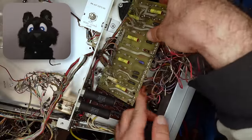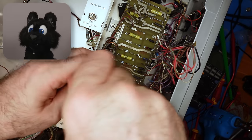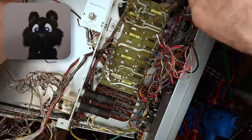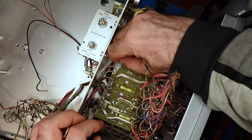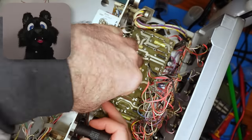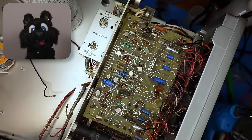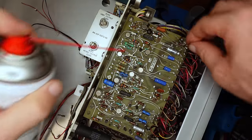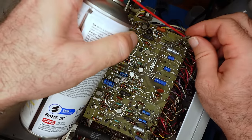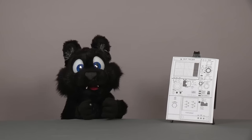After the caps are connected again, I bring in the rectifier board as the first PCB to go in. AC goes in on the left, DC comes out at the right. And the regulator board on top of that. Connecting the rectified and smoothed DC as an input, the power transistors at the back and the output voltages, this finishes up the DC supply side to the best of my knowledge.